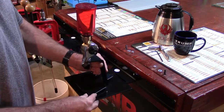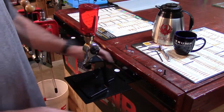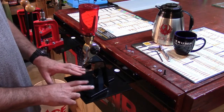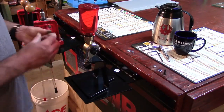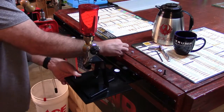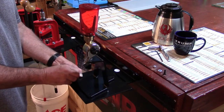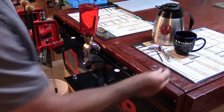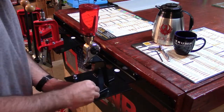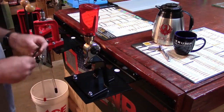We will take our stand and we'll get it set up, line it up for the holes. Now, one thing I got to tell you, the storage dock and this rail by Inline Fabrication makes it really nice to get the equipment set up on the top plate. We'll take this bolt. You're going to need a 5/32 hex wrench. Run your bolt through, take your washer, and then take this provided nut and run it all the way down as far as you can get it by hand. Then we'll take the second one, run it through there like that, run your flat washer, run that second nut.